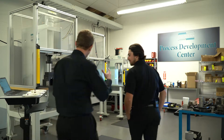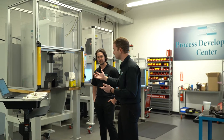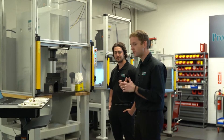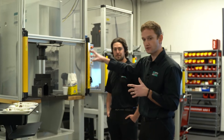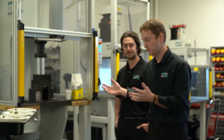Okay, so coming back here, we're going to be using another workstation just like we were using. It's a larger workstation with 120 kilonewtons of capacity. Oftentimes, in especially powder compaction type applications, it requires a servo press to have the accuracy and force scalability of a servo press.